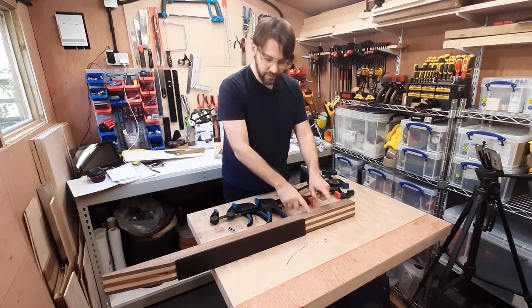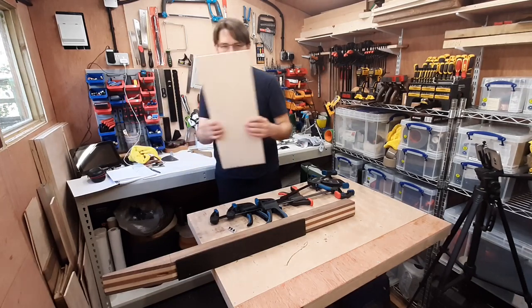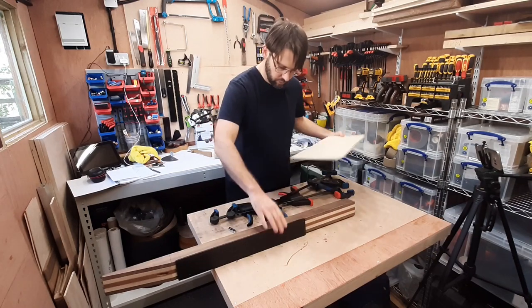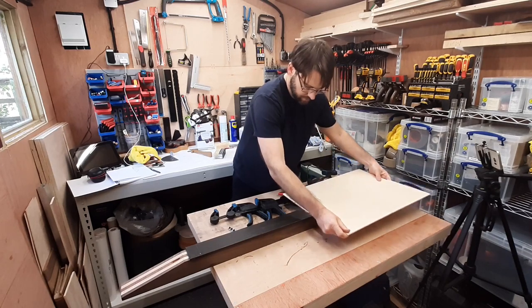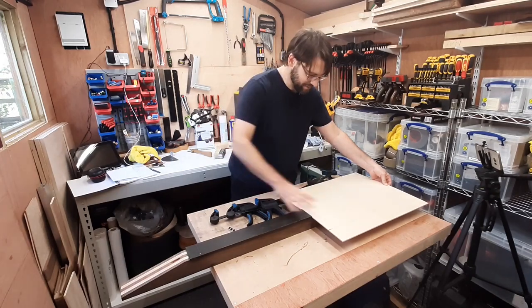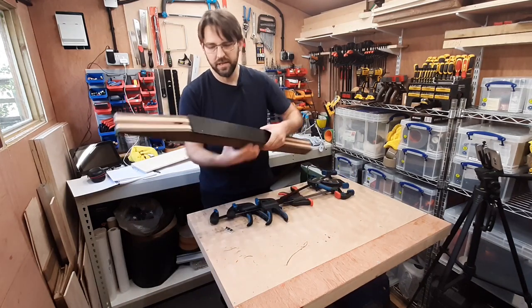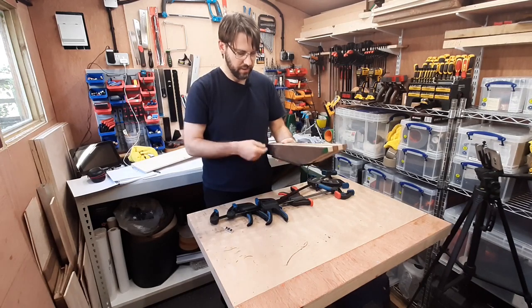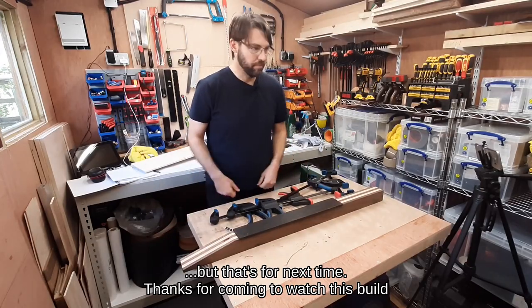So cut that away. Also need to include space for the top, which is currently 4.2 millimeters. That will become the body over here, which of course is not going to be an acoustic shaped body, it's going to be a shark fin V. So what's next? Radiusing the fretboard. Before I can radius the fretboard, I need to trim off the excess here and make sure these sides are flat. Right, that's today's job. See you guys later.